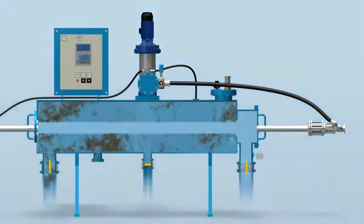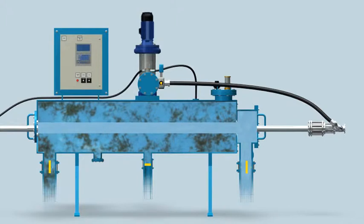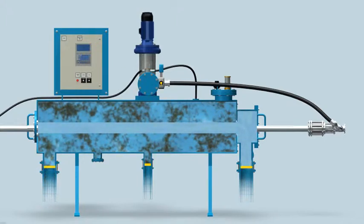The cleaning sequence starts with the control unit starting the flushing pump, which boosts highly pressurized clean water into the system. The inlet and the outlet control valves are then closed, isolating the filter from the main line. A few seconds later, the drain control valve opens, emptying the filter.